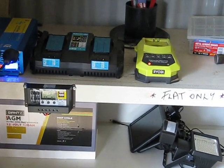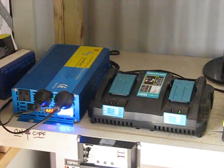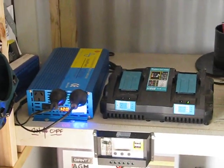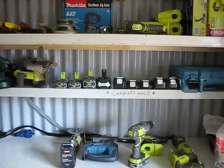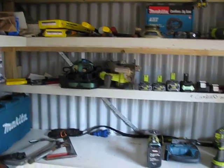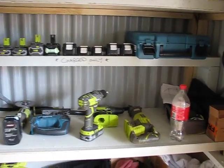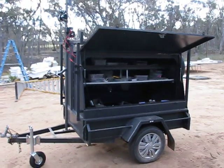It's got a 130 amp hour battery and a 120 amp hour battery, with a 300 watt panel on the ground outside, all through to a little dinky controller - nothing expensive. Even a little 1.5 kilowatt inverter with plugs built in, so you don't have to do any 240 wiring. It charges all our batteries, and we do have a lot of batteries. Our little shed is now solar powered with 240 volt to do all the charging for all our battery tools and the jib crane.